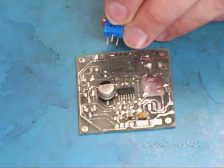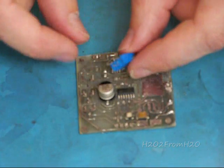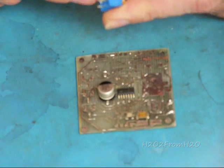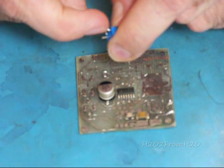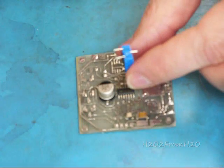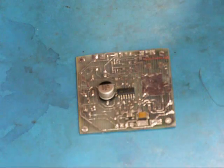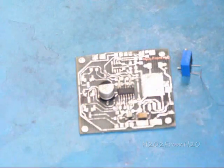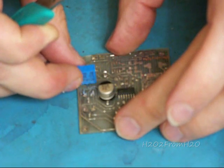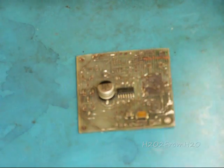So this is VR1. This is a through-hole component and we're going to turn it into a surface mount component. I'm going to take my thumbnail and bend this leg over so it sticks straight out, then bend this leg over, turn it around, and bend this one out. So now we have a way to surface mount this. You can apply a little bit of pressure to help it seat down. Then take a pair of clippers — fingernail clippers will work — and trim it to fit that pad. Right now there's an excessive amount hanging over; about an eighth needs to be left hanging, maybe a little more.